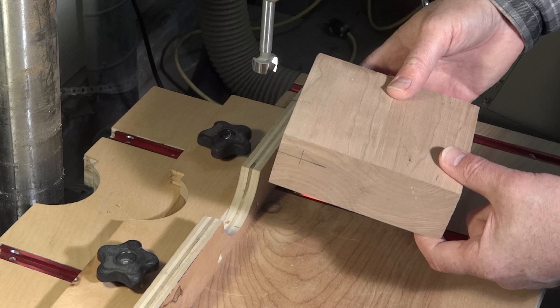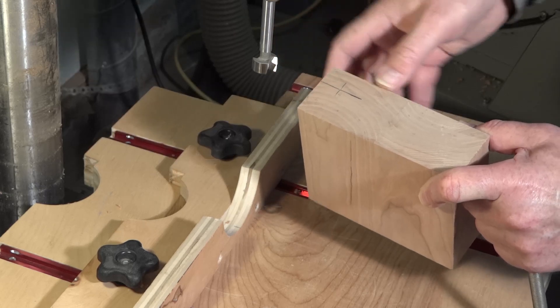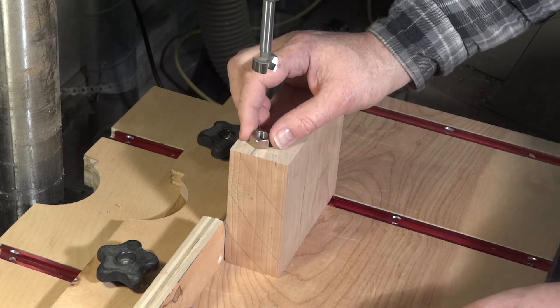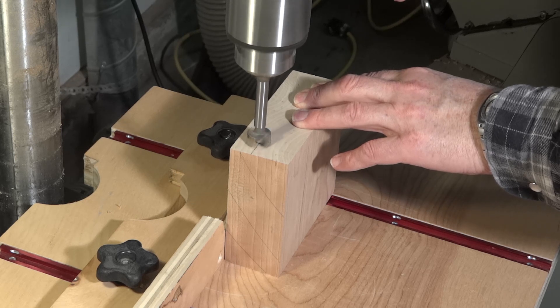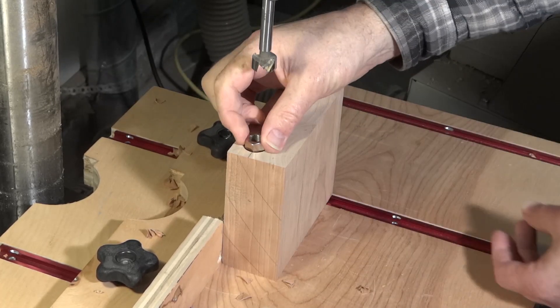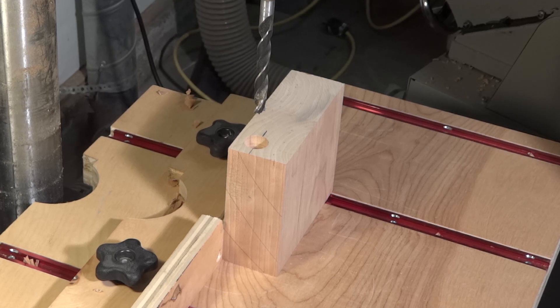This is the blank I'm using to make the body — this is the front face of the blank. I've made a mark three quarters of an inch from the front and three quarters of an inch from the top. The first thing I'm going to do is drill a recess to fit the nut that will go on the threaded rod, just drilling that deeply enough for the nut to set in there. I was using a 13/16 inch Forstner bit so I'd have a flat bottom for the nut to sit in. Now I've changed it to a 7/16 inch brad point bit to drill the hole through.